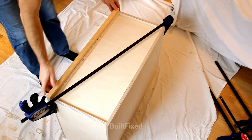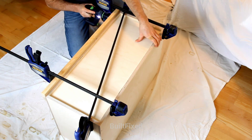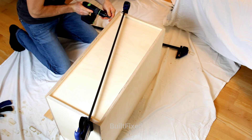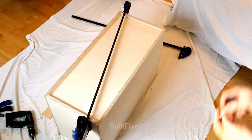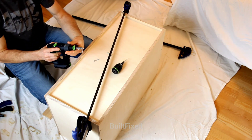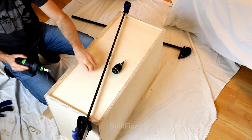Here I'm using another shop-built custom template for this cabinet to drill with. The holes were first drilled on the drill press to ensure that I would have a very 90-degree hole to the face of the template and the cabinet. If I was just going to do one or two, I would probably just mark it out in the cabinet. But this template really ensures that I'm drilling 90 degrees into the cabinet and I don't accidentally poke through the piece of wood. If you can use a template, it really helps to speed things up.